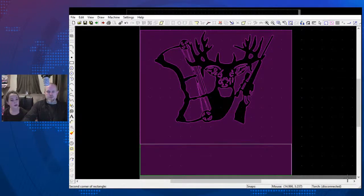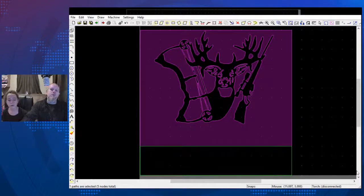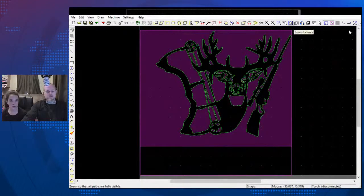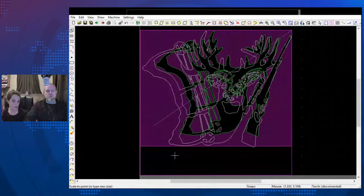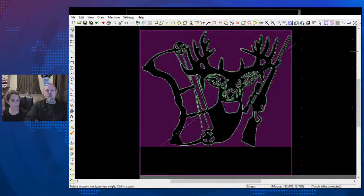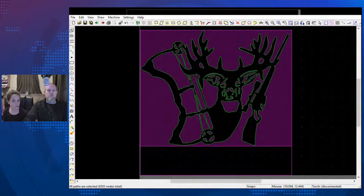We're going to do 15 wide, comma, 3 inches tall. And now we're going to scale this. We're going to hit S, N for node point, select that corner. We're going to drag it out till it touches there. We're going to hit scale, node point, and drag it out till it touches there. And I'm going to rotate it just like that.